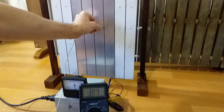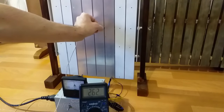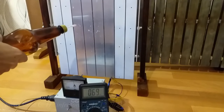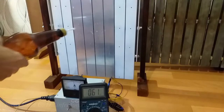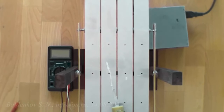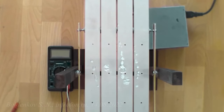In case of mechanical damage or splitting up to 3 by 3 millimeters, these fragments will also work and heat. The difference from industrial convectors is that the entire metal area is heated, not just a small kilowatt heat source inside the industrial convector body. It is necessary to put mesh protection on the heater so as not to get burned, or paint it with chip-resistant high-temperature paint, and lay thicker wires in a fireproof channel.